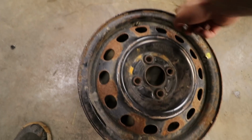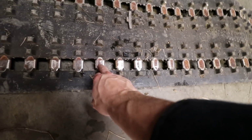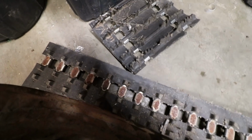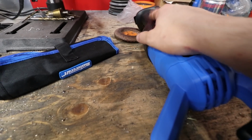Talk about taking a ride on the struggle bus. So we got that tire off, as you can see. We grind down this part of the rim right here, and then we grind down these little cleats in the track, and then we just weld them to these. And the way this wheel fits is it's gonna sit flush against those ribs on the back, and then we can weld them straight here, and then we end up cutting the track right here on the outside of these things. And instead of a grinder this time, we got the reciprocating saw today, so less dust in here.